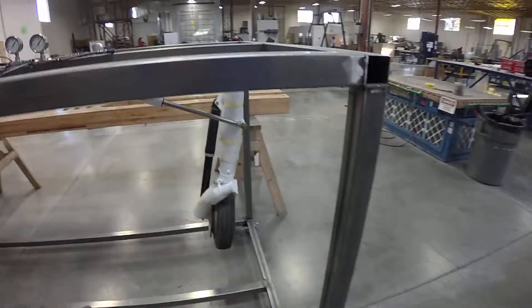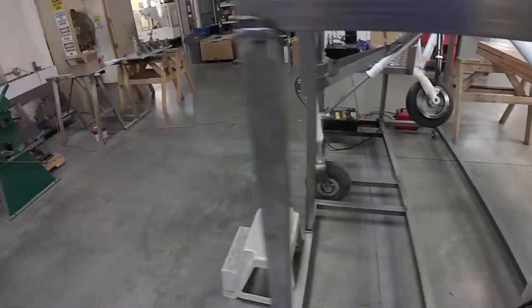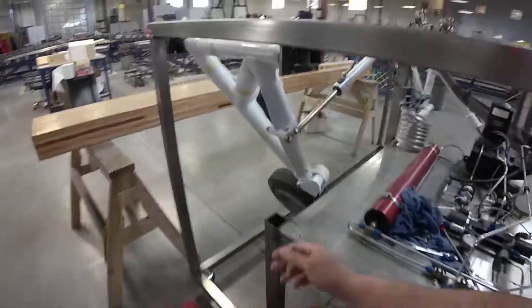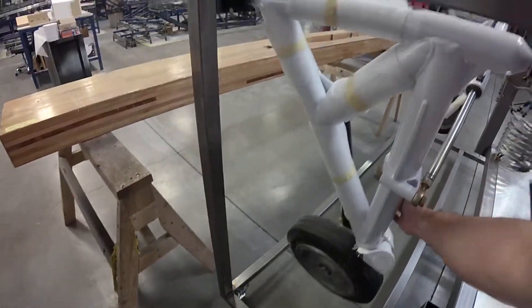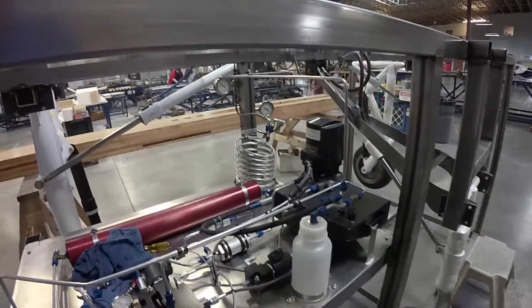Of course, if you follow the POH and you wag the airplane, the mains will come out and lock. The gas strut tackles the nose gear, and everything works as the POH tells you to do.